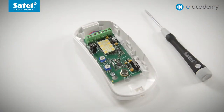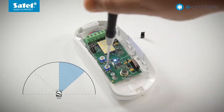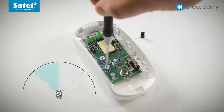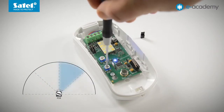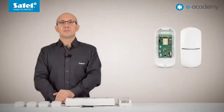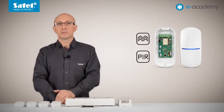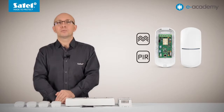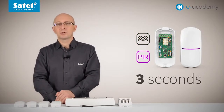To enter the configuration mode, remove the jumper from the LED pins within 10 seconds of the detector power up. The LED is now flashing the color currently selected using the PIR potentiometer. The color of alarm or trouble signaling in dual-tech detectors is set in the same way as in the PIR detectors, so I set the PIR potentiometer to the position corresponding to the selected color. In the slim dual and slim dual PET detectors, the LED signals an alarm when both sensors detect motion within less than three seconds. The LED can also come on when motion is detected only by one sensor. The colors are assigned permanently: purple for the PIR sensor and green for the microwave sensor. If motion is only detected by one sensor, the LED will glow the right color for about three seconds.